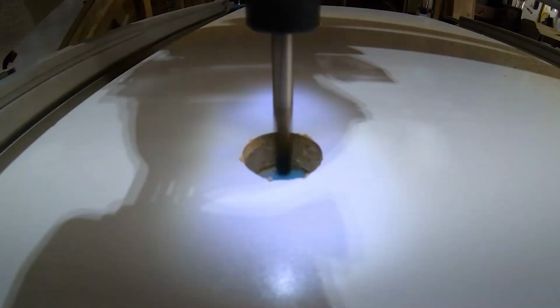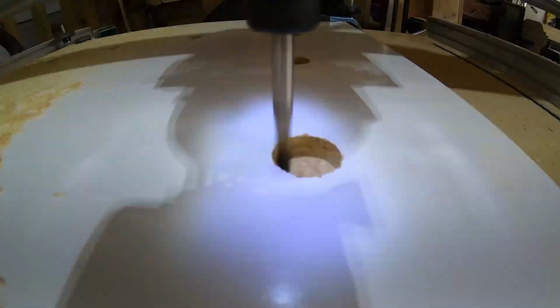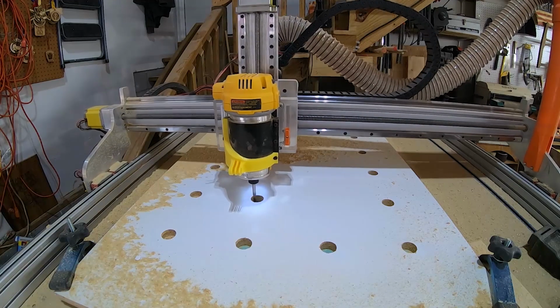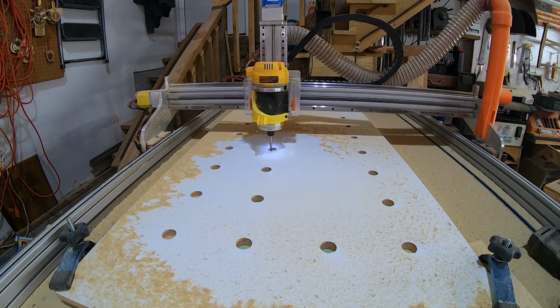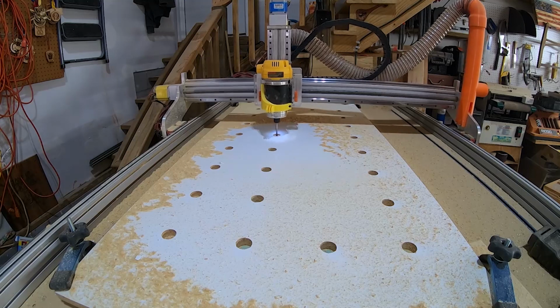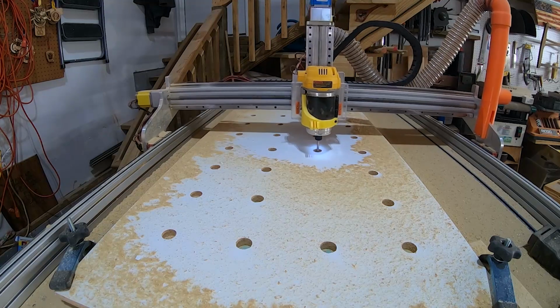These are bench dog holes. This is what we're using to stick clamps up through. It's also used for bench dogs, which I will actually demonstrate in the next video. These are 1-inch circles, 1-inch holes. In hindsight, I should have used 3/4 because there are no 1-inch bench dogs. So I had to make my own out of dowels. Again, I will show you exactly what I'm talking about.